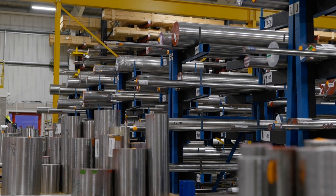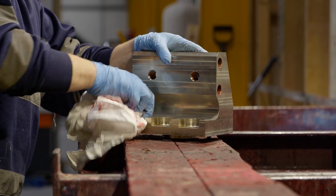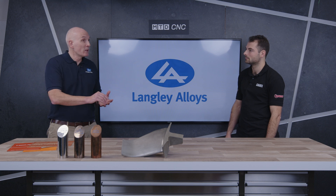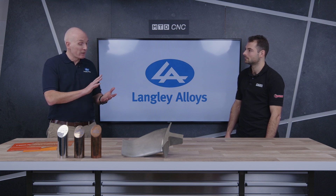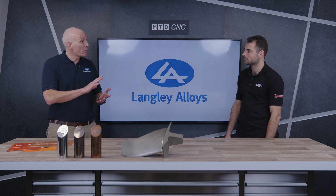It's one of those products that's found its time. Originally it was all about naval applications, but it's got this cool combination of mechanical and physical properties that make it perfectly suited to subsea components. These days there's all sorts of kit and equipment sitting at the bottom of the ocean, operating and controlling various parts of oil wells. It needs strength, it needs corrosion resistance, but it also benefits from that non-fouling — that resistance to build-up of algae and barnacles — but also galling as well.